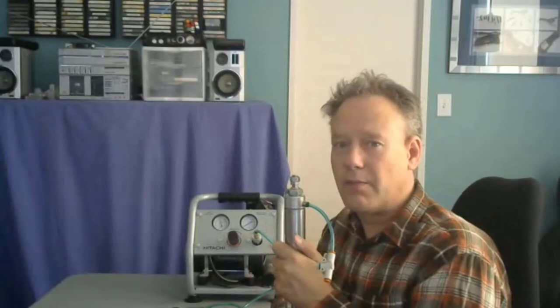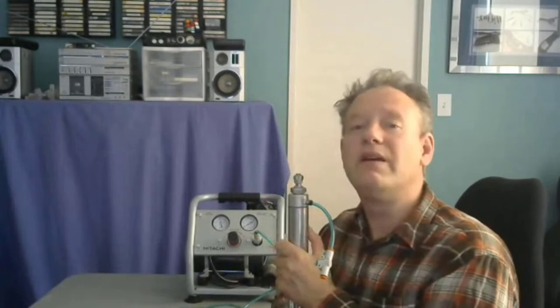No matter whether I'm doing that with hydraulics or pneumatics, we can see that as I throttle this, this thing moves slowly. Now, you understand throttling. You get that. I keep calling it throttling because in this case we're using a one-directional motor, so we're actually throttling. We're not doing metering. Let me say it this way: we're metering by throttling only.